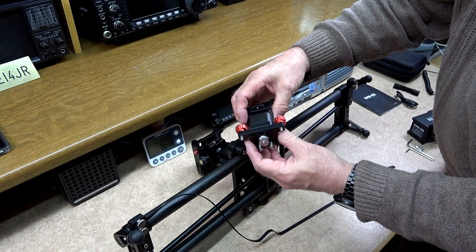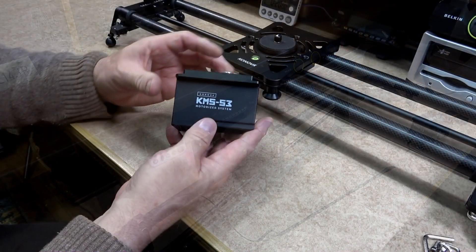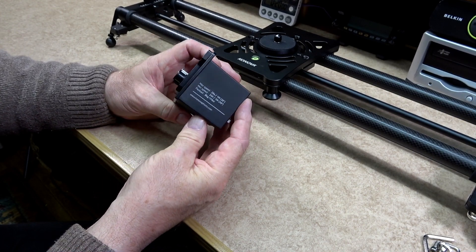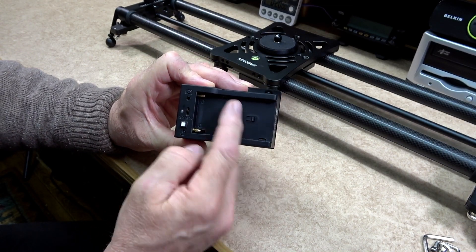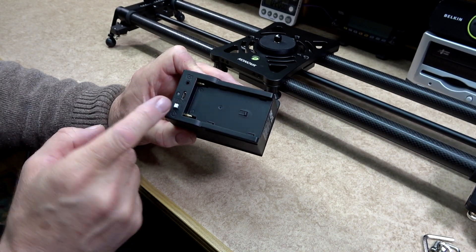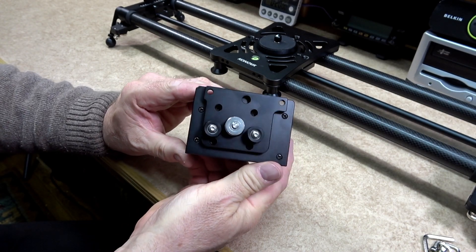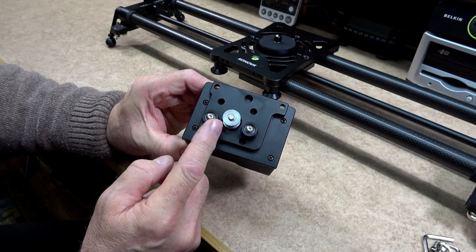You can store the old motor in the case that the new motor came in. The KMS S3 motor module is made up of a mixture of high impact ABS plastic and alloy. All the electronics are in the main plastic box section, which houses the shutter release port, the power input, the LED indicator and power button. The battery mount is for Sony NP750s or 970s, which are not provided — you will need to supply your own. In the alloy section can be found the bearing and belt pulleys, with mounting holes on top to connect to the main slider unit.